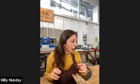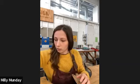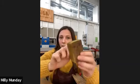So basically, to make wax multiples, first of all, you need a mold that is suitable for wax injection. And there are two ways that we can make these molds. One is hot, in what we call a vulcanized rubber mold, and the other way is cold, in what's just a silicone mold. So to show you some examples first, these are vulcanized rubber molds.